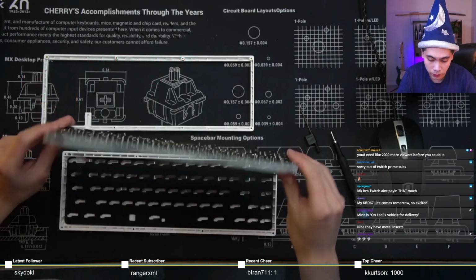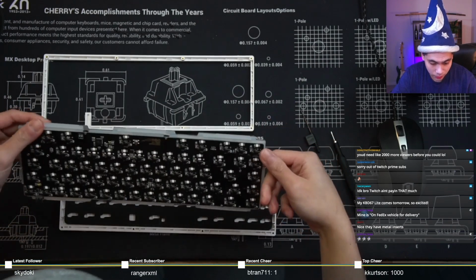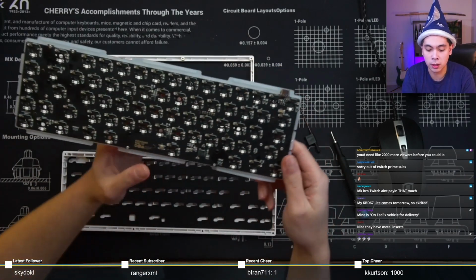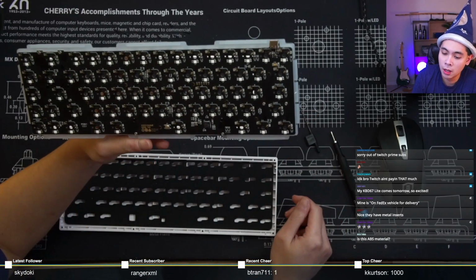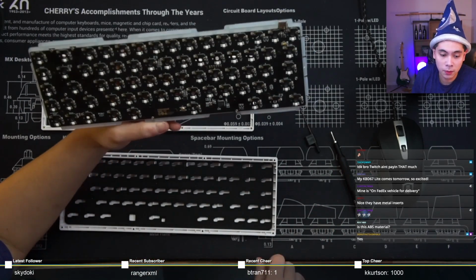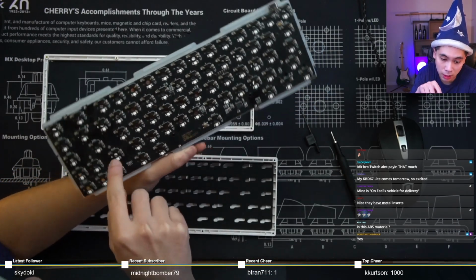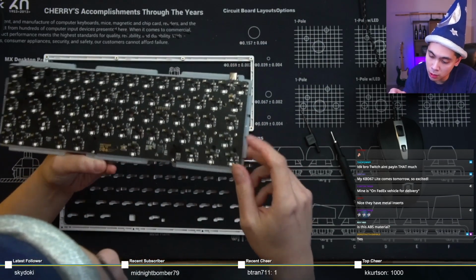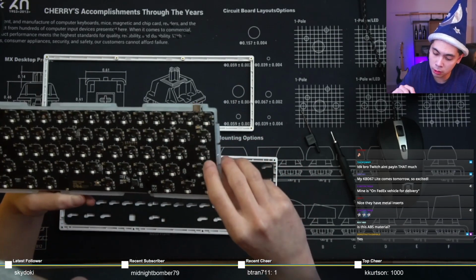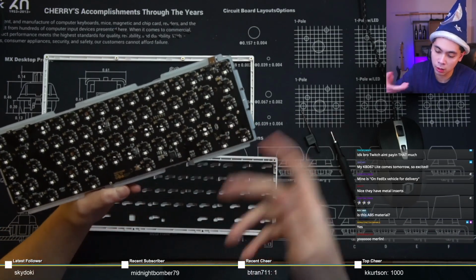All right, here goes. Okay. Yep, this is confirmation that the PCB uses a KBD67 Mark II RGB V2. This is the same PCB that's in my KBD67. So yeah, there we go. And yes, confirmation that these are indeed screw-in stabs. Unfortunately, these screw-in stabs do not have any washers in them. So if you are concerned about shorting your board, that may be an issue that you are worried about.